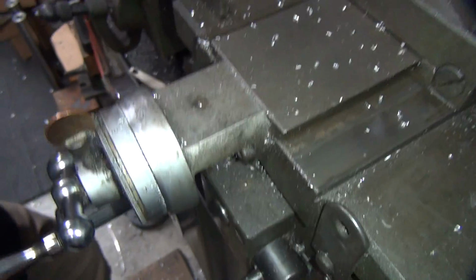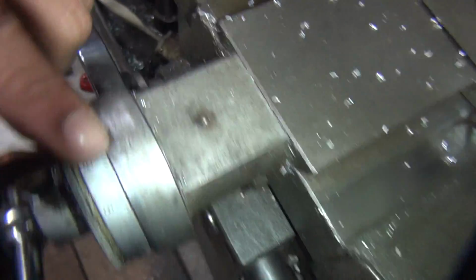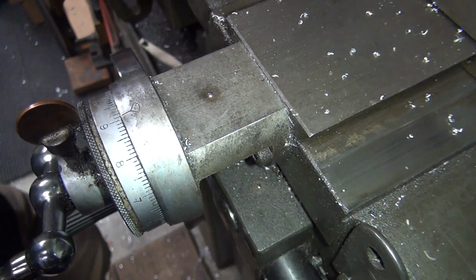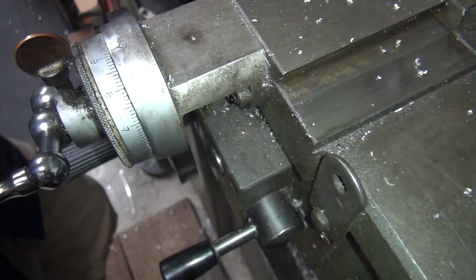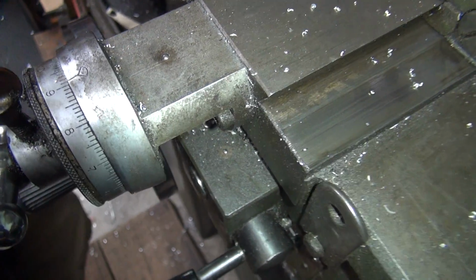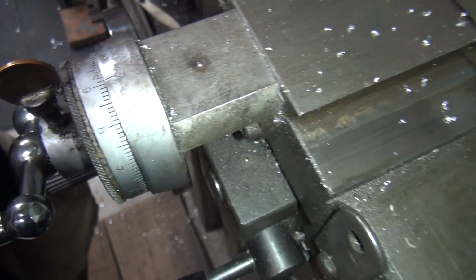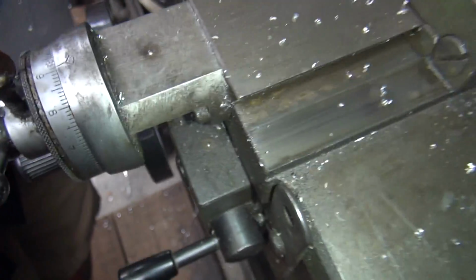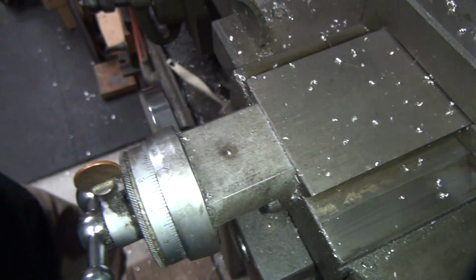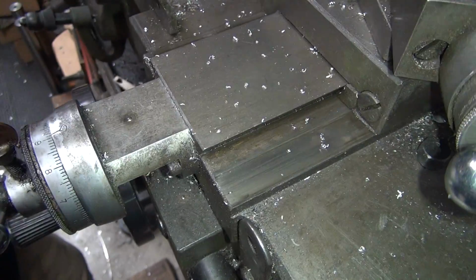So we were on what number when you started here? Do you remember? 10. No, 10 was over here. You're about 3 lines past 10. Oh, we were? Yeah, which is 6 plus 10, which is 16. No, 10 is 20. And you had 3 lines over here, which is 6. So 6 and 20 is how much? 26, but now you're confusing me. So now you're cutting 26 thousandths, because I saw what that was before you moved it. You didn't pay attention.